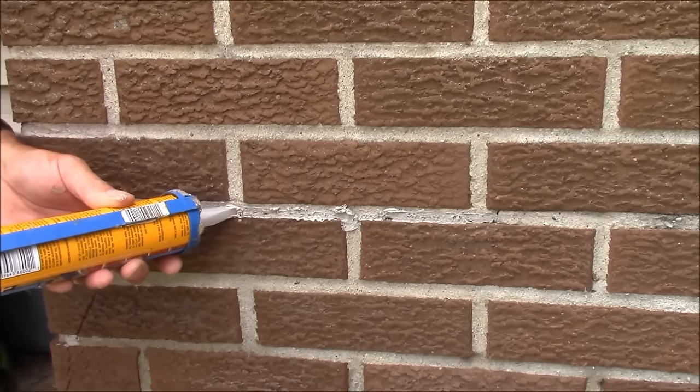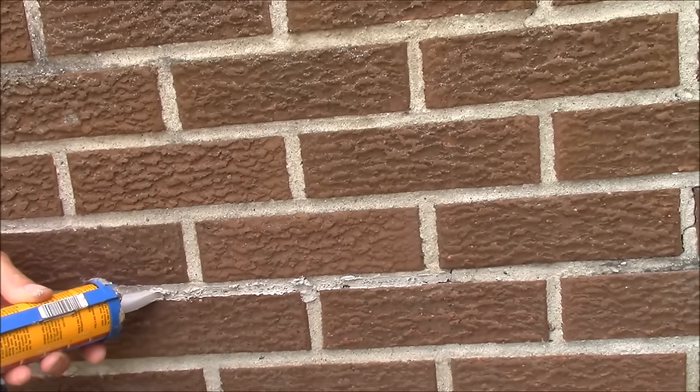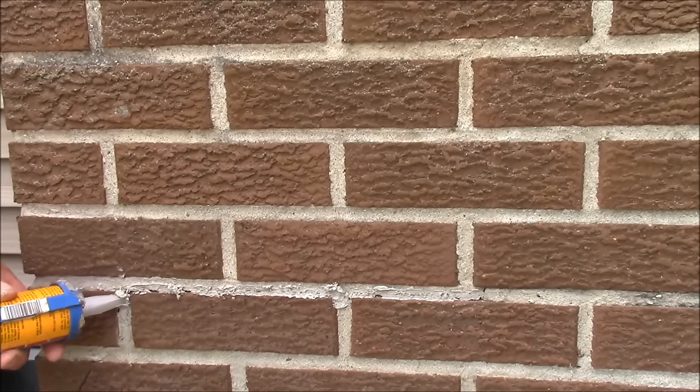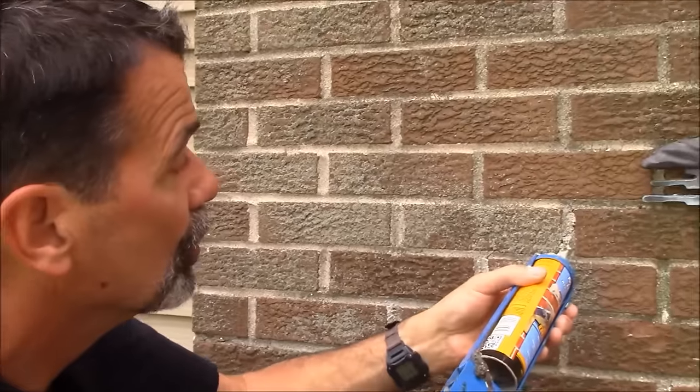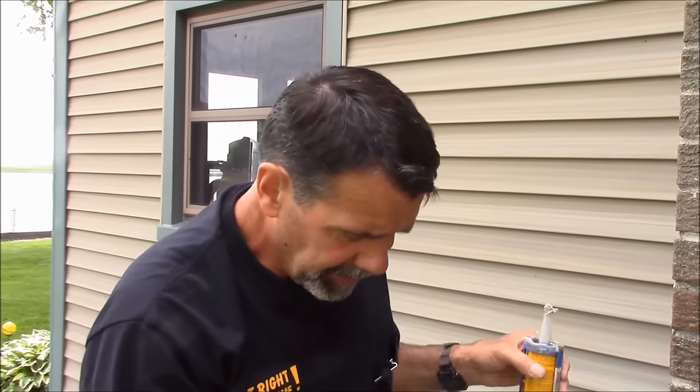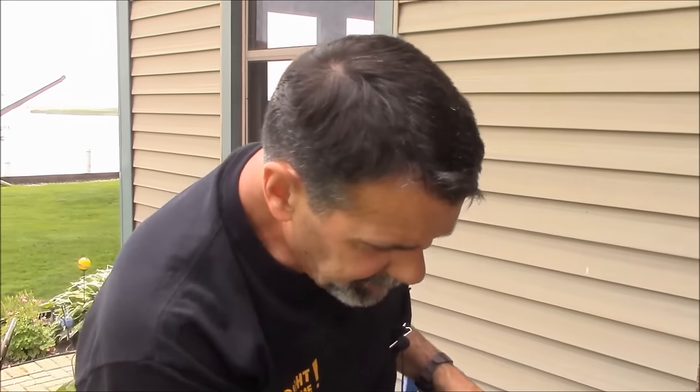Here I'm doing a hairline crack where water coming down the chimney will weep right into that crack. The goal is to keep water from getting on the backside of those bricks. When you see these cracks coming through the brick in a stair-step pattern, it's obvious that this chimney is settling. If it was settling really badly, I could look at having it excavated underneath, piers poured, and brought back up and supported better — but that's an expensive proposition. I don't put any of this gray mortar caulk in the bricks; it'll really stand out.